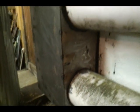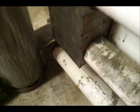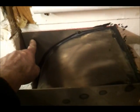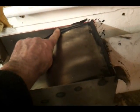I shoved the pipes into it and just wiped them with high temperature sealant and it's done a good job. A good thing about these bends was that because I used this plate I was able to fix them on the wall with screws, so it's got everything really solid and held in place really well.